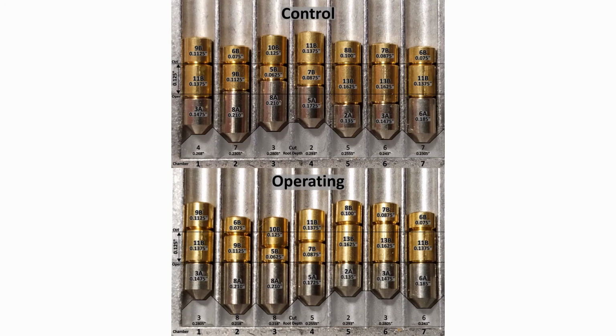So the whole point was trying to understand why it's easier to pick some locks than others. Some are easier because of common chambers that have the same key cut operating both the control and the operating shear line. But in this case, none of them do. So this lock is more difficult to pick than most. And if it's master keyed, then there are more shear lines, but remember, those shear lines will all be in the operating shear line. So that's really where I wanted to go with all this.